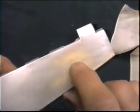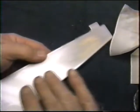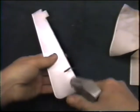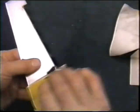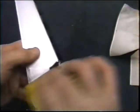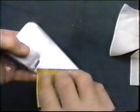I'll probably just sand the whole plane down — the parts are not that difficult to sand at this point. You get an idea of how much — look at this, we have a brush mark here and there, the one spot I picked. It's buried in the finish, but now you can even feel how nice it is. Any spot that's a problem — keep the sandpaper wet, keep it flushed. You can use a little sanding block. We want to basically look for any little flaws we're not going to be happy with.